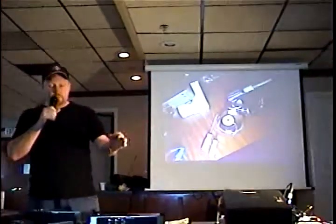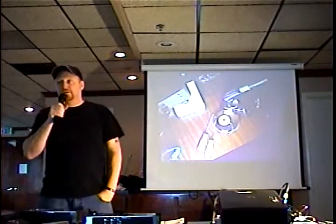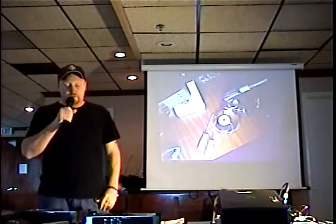But basically, what we're going to be talking about is we got two points that we need to bridge, two little pads of solder that we need to make a connection across. However you do it, it's your choice. I got to the point where I really kind of like this nickel print because before my soldering iron's even heated up, I can be done with nickel print. Just take a toothpick, drop it in there, put two little drops on the board, and I'm done. It dries real fast. By the time I've got the case back together, it's good.